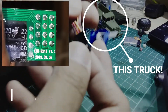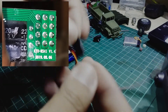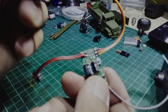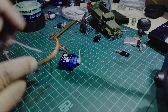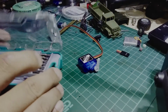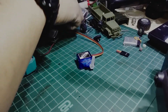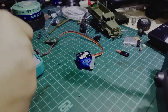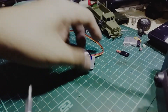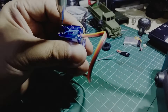I'll be using this on a truck — you can see the green truck at the back. The servo comes with connectors but I simply cut them off and solder all the wires directly to the receiver board to make everything smaller so it will fit nicely in my project. Now I need the smallest screwdriver that fits the screw holding all the servo parts together. Let's remove the four screws in every corner.